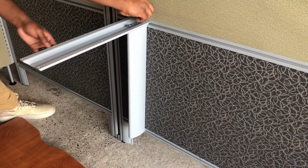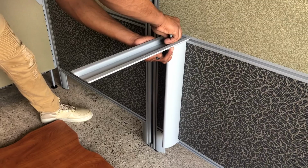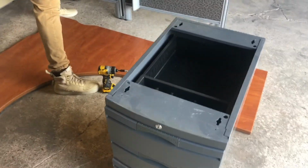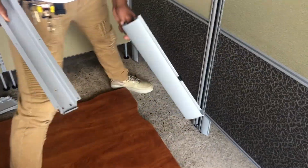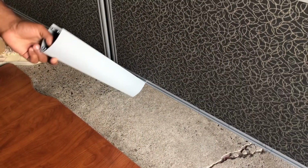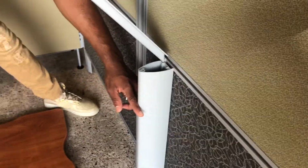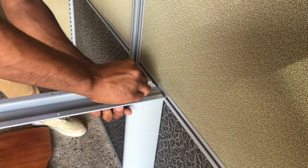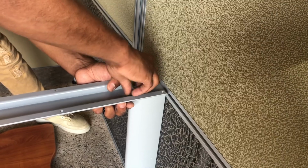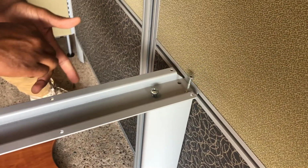How you hooked it all in there, the first leg. We're gonna show that one more time. This particular bracket goes on the side where you have your filer and your small piece of desktop. You hook the first piece in, the bottom ledge, stand it up, hook the top piece in the ledge here, and put the screws that should have came right in those, right back in the big one in the middle, with the Phillips head. Then the 2 square head, longer, skinny ones go in the back.